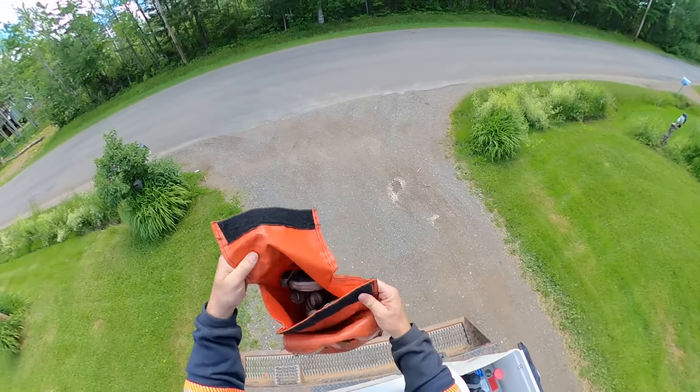Customer's happy. Usually we'll run into this more with commercial customers on a pad-mount transformer — pretty well all of our pad-mount transformers have the tap option to adjust the voltage. On the residential side it doesn't happen often. We spoke to a few customers and let them know what we're doing, and everyone's happy with the lower voltage. We're going to pack it up — I've got to meet a guy about 20 minutes away in 19 minutes, so we need to hit the road. As always, thanks for stopping in guys and see you next time.